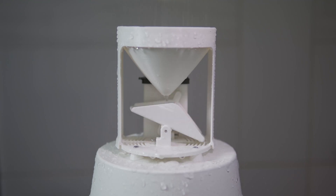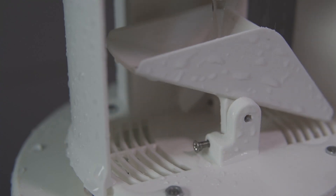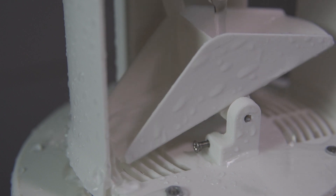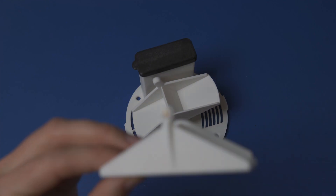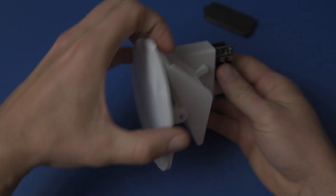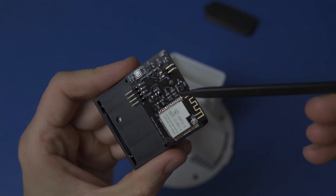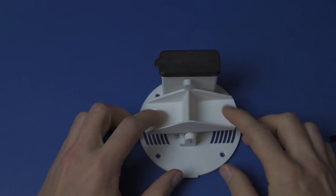Time to review how the final version works. If we know the diameter of the top part of the funnel, the amount of water that fits in one bucket, and the time between each tipping, we can accurately calculate how hard it is currently raining. There's a magnet at the top part of the tipping bucket. Inside the tightly sealed container, we've got our PCB with a Hall sensor — it detects the change in the magnetic field when the bucket swings. The microcontroller measures how much time passed since the last tick and converts the unit to liters per square meter, then sends that info to Home Assistant.